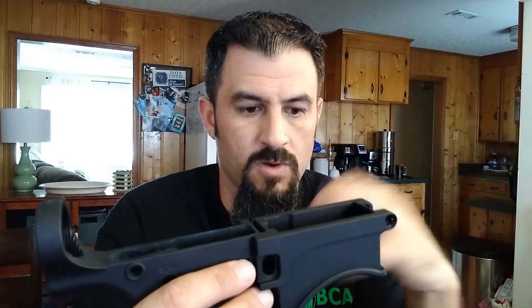If you're only doing one side, I'm going to recommend gluing from the areas where the takedown pins are — that's just my preference. I think it's easier to align them. You can push the pins through a little bit, then set the upper and lower on top, push the pins through, and let everything set up. If it's the other side, you might have to use a small punch or pick to help guide it if it slips, and then just run the pin through. Don't be afraid about epoxying your upper and lower together. I wouldn't recommend you just douse epoxy in there — just use a Q-tip to dab the epoxy on the shim and that way it'll stay in place. It's a lot easier to get these shims to stay in place if they're on the side where the pins are, because if they fall off or have an alignment issue, you can work the pin up in there to still get the upper to seat and push the pins through.